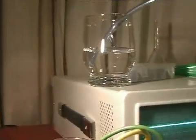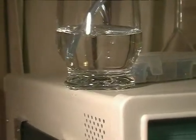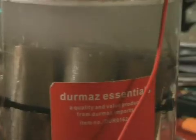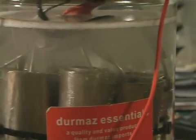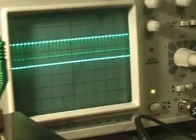That's it for now. The bubble count is about one bubble a second. You can see it's at high duty cycle. If I bring that back down to about 50% mark-space and look around different frequencies, you'll notice the cell clears up quite a bit and gas production rate goes down. No matter where in the frequency range I go, it doesn't seem to be anything overly impressive.